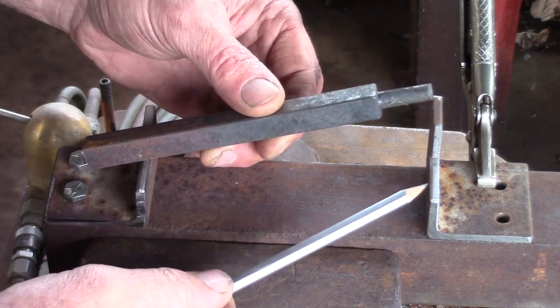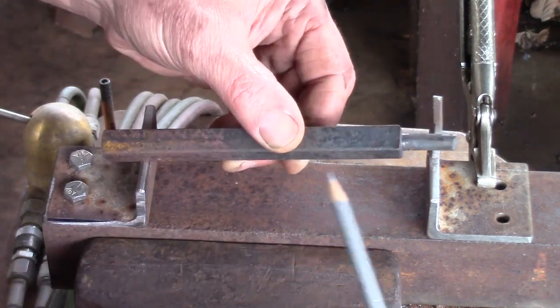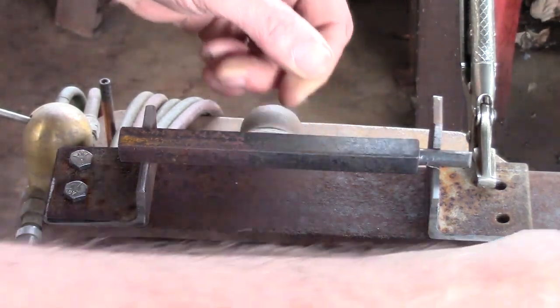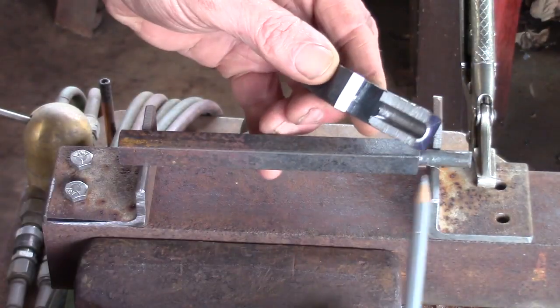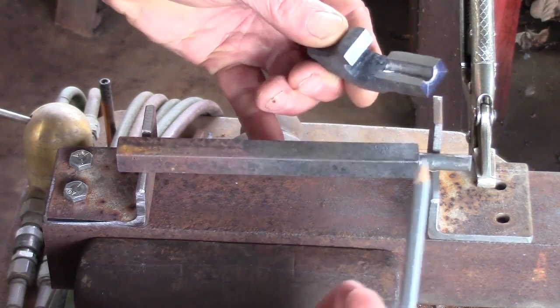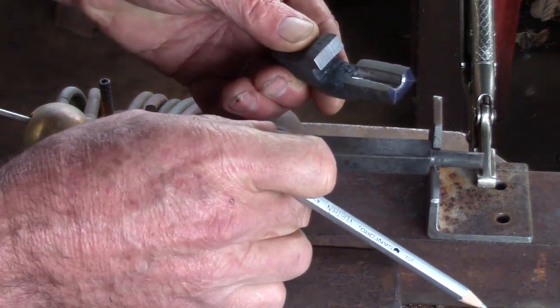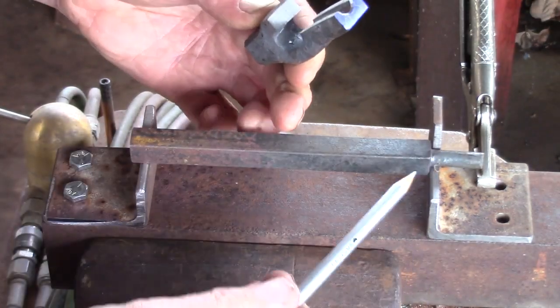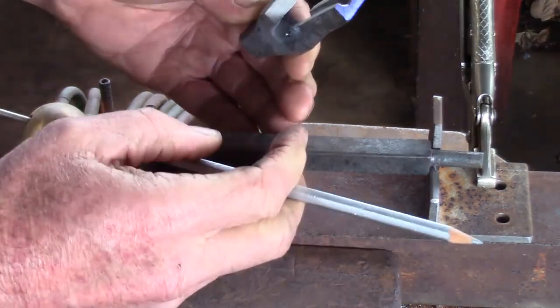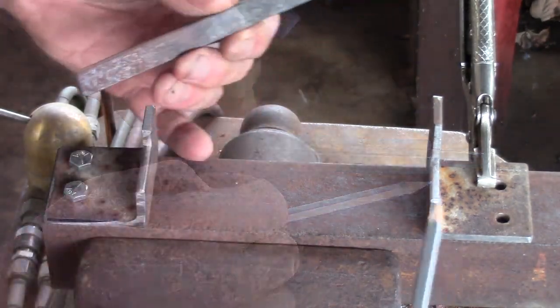This gauge has got a chamfer, and that chamfer is the same size and shape as the root of my tenon. A monkey tool has a chamfer to the inside which gives a chamfer to the inside of the root of the tenon, so there's no stress riser. The shoulder needs to sit up against this angle iron without interference, so you've got to relieve that edge.